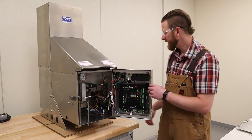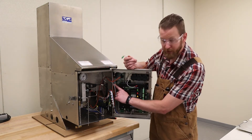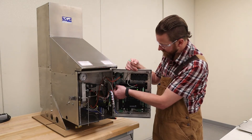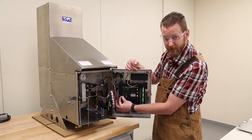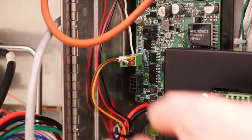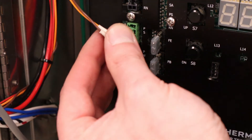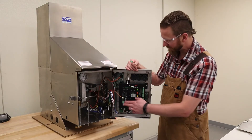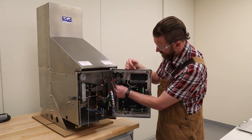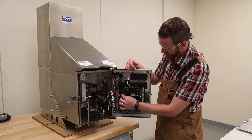The next thing we'll need to work on is our wiring harnesses. We're going to start with the two-position pressure switch harness, which will replace the pressure switch harness that's currently in the SI module. The existing pressure switch connection is going to move from the SI board down to the remote start panel. The wires can be quite tight — it's as simple as pulling them through the zip ties to give you a little more slack. This harness has the same connector that will replace the pressure switch on the SI board, and the two-position connector will attach to the IG terminal on the remote start board.